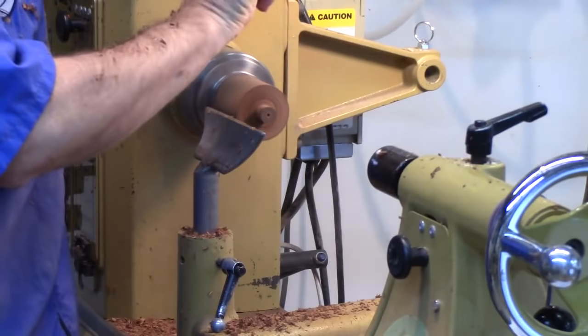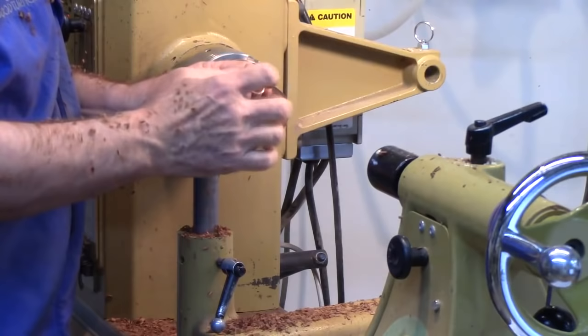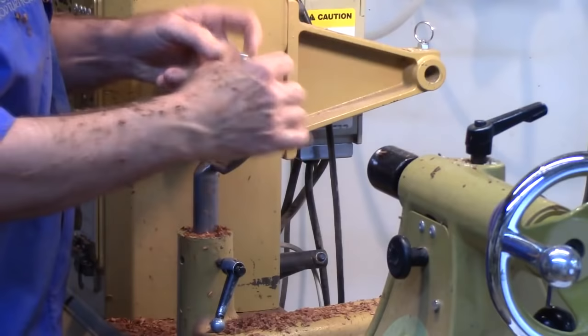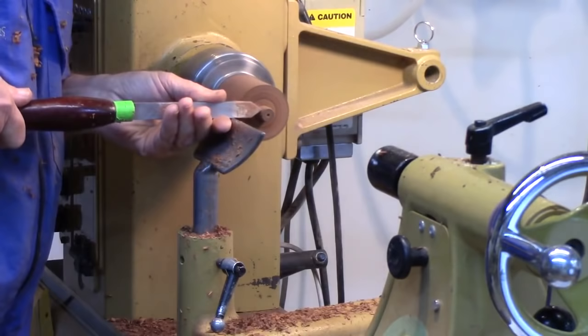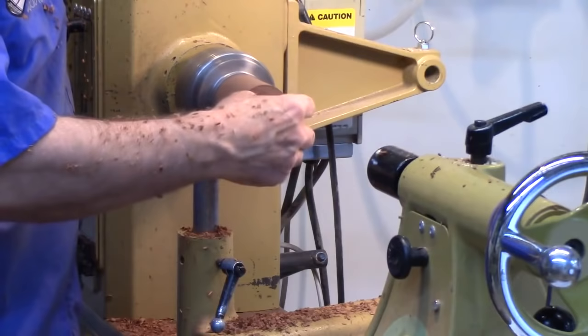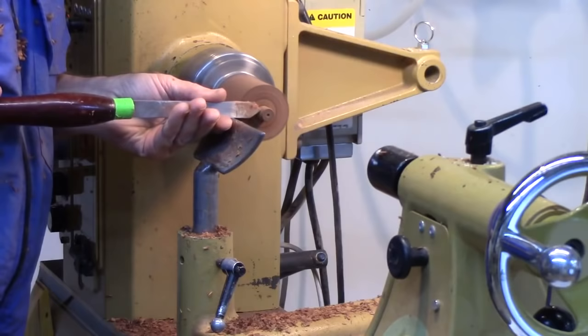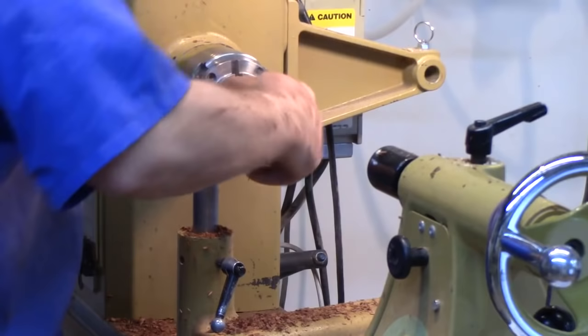Simply going to hold it in the back — one-hand operation. By the way, when you're using copper pipe and cutting it with a pipe cutter or hacksaw, make sure you deburr it with a deburring tool, a reamer, or a little sandpaper so you don't have any edges that'll give you a false fit. I don't like to have a sloppy fit — I'm going to epoxy this on, but I don't want to pound it on because it's soft copper. That's a pretty tight fit.